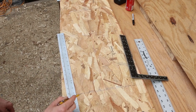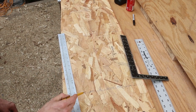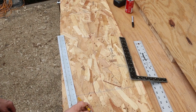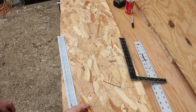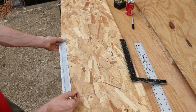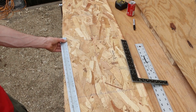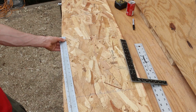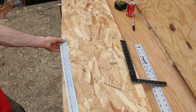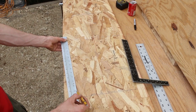Now in the drawing, this is a pretty square shape. In the drawing, this down here is curved, which means we either need to take some width out of the bottom of the ballast keel, or we need to add some to the width over here so we can get that roundness. Does that make sense? Yeah, it looks like taking it out might be a better shape. Or just leaving that line straight and just rounding it out. Kind of rounding the corner.